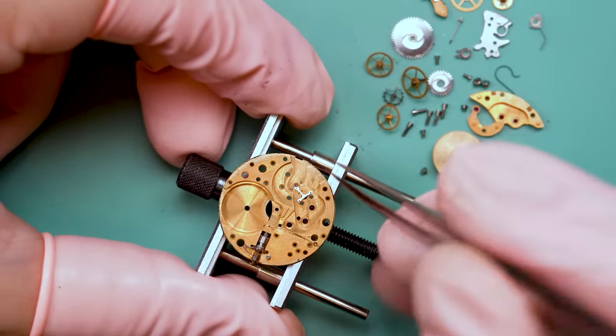All that rust is just completely gone — gone enough that I could simply pull that cannon pinion out with no effort whatsoever. It turns everything kind of charred-looking — some chemical reaction, I assume. There is still some visible rust on the hour wheel, but I can scrape at this with a piece of pegwood and put it back in some evaporust — that should take care of it. This looks mainly cosmetic at this point, not structural. But here's the big question: did it work on the stem that was completely rusted into place? And as we can see — that's clear now. It moves a little bit, and there we go — it's out. That's a huge relief, because this thing was well and truly rusted in. The evaporust really worked well.